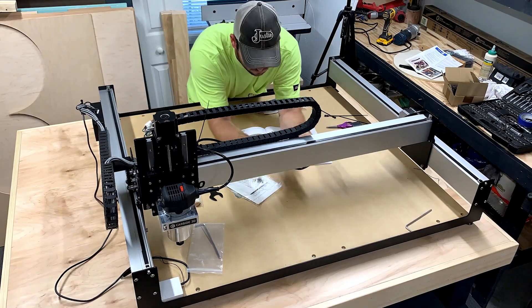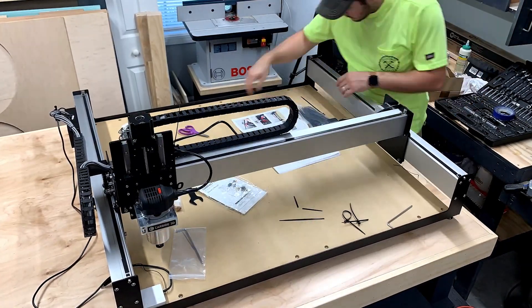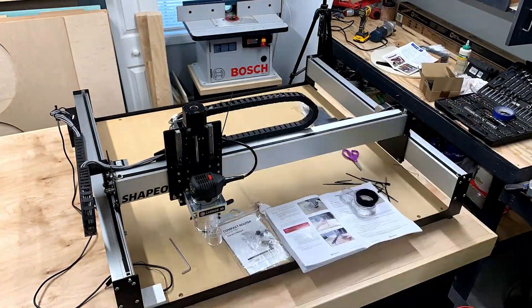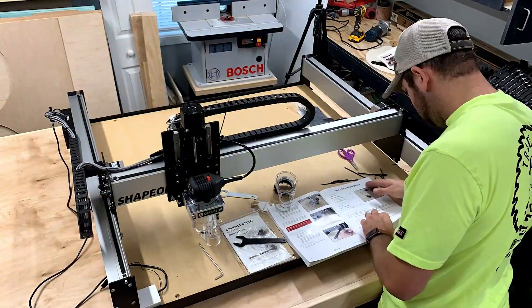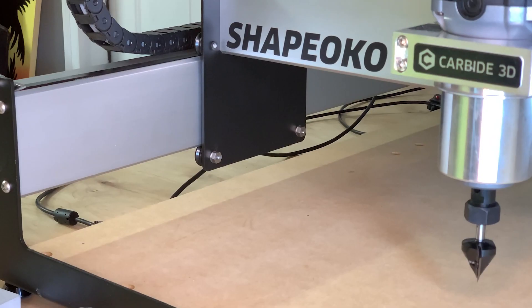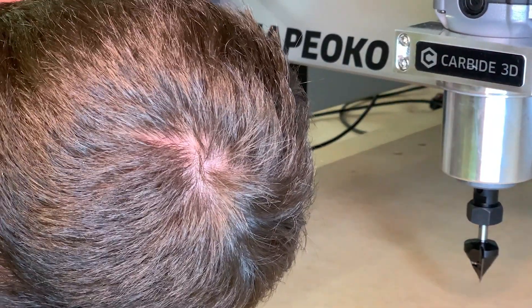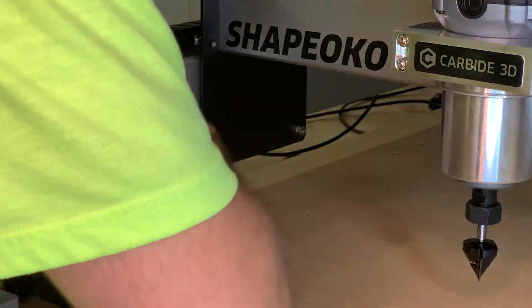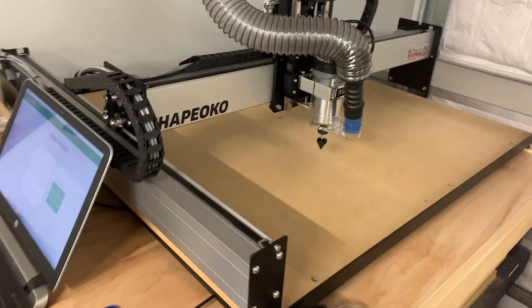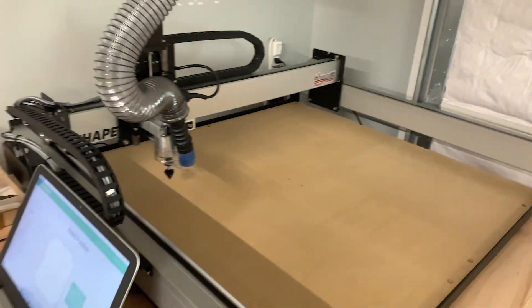We set the router into the housing and I'm making sure I have enough slack as it moves across the X-axis. You'll put some clips on the back — basically clips made from zip ties — to hold it in place so it has enough slack to move freely but isn't dragging on top of the wasteboard. Well, there you have it — it's complete, all set up. All you have left to do is square the machine up and put on who made the machine. I actually used my Cricut Maker to engrave my name into the plate. You could just use a marker, or even use the Shapeoko if you had an engraving tip ready to go. Then I did my first jog — testing all the axes, making sure everything's running smoothly and nothing's dragging.